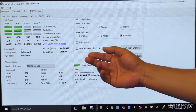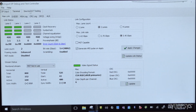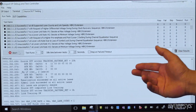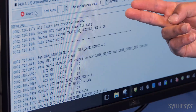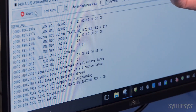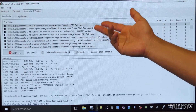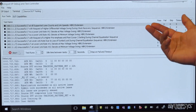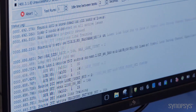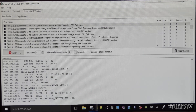Here we see that the link has been trained and we have two active links — lane 0 and lane 1. We're running two active lanes. I'm going to switch over to the source testing and start running these tests. These are the link tests, and you'll see that as we run through them, we're getting passes. For example, we're running a two-lane link at different link speeds, and the link test for a request of higher differential voltage swing during clock recovery sequence. These tests specifically show that our solution passes compliance tests and truly earned the certification.